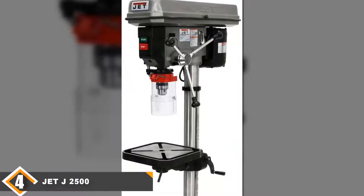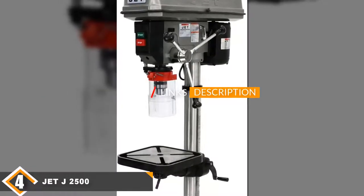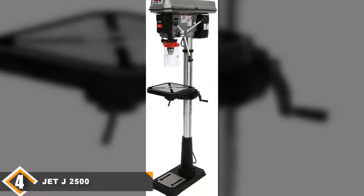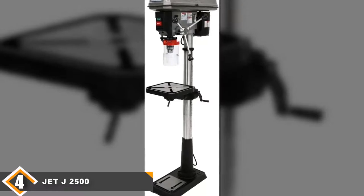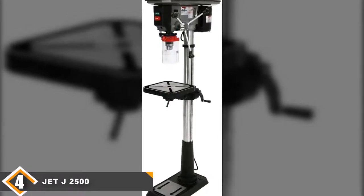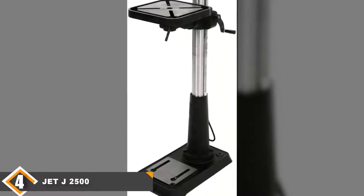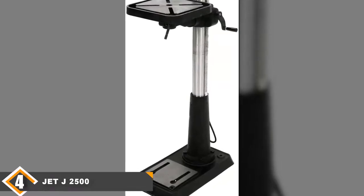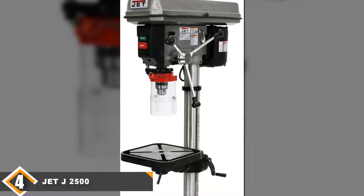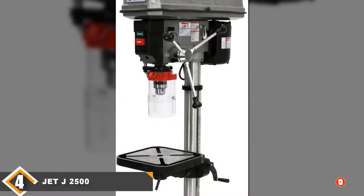Next at number 4, we have the ZZ2500 Cast Iron Floor Drill Press. When it comes to choosing a professional floor drill press for your shop, ZTools is one of the brands you can always trust, and this ZZ2500 offers a lot. It features a cast iron head with a large quill, permanently lubricated spindle assembly for long life, and a precise depth stop. There are 16 speed settings producing anywhere from 200 to 3630rpm from the 0.75hp electric motor. You can use up to a 5/8-inch drill bit on it for cast iron or a half inch for mild steel. This press has a 15-inch swing and ZTools backs it with a 2-year warranty. There is no onboard light and no laser guide, and the table only tilts to 45 degrees and not a full 90 degrees.